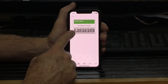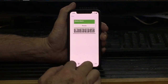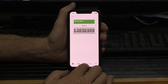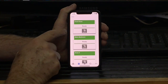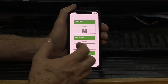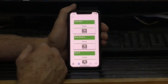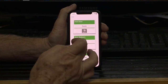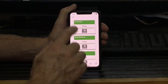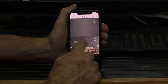The Away button arms the system in full mode, Stay arms it in partial mode, and Off turns it off from whichever mode it was in. Down at the bottom there are icons including Sensors — tapping it shows your zones such as front door and main bedroom, shown in green when ready. You can name all the different zones to match your premises. There's also a Bypass key, handy if you want to bypass a zone — for example if you've left a window open and the blinds are triggering a detector. There's also a History button to view the alarm history.